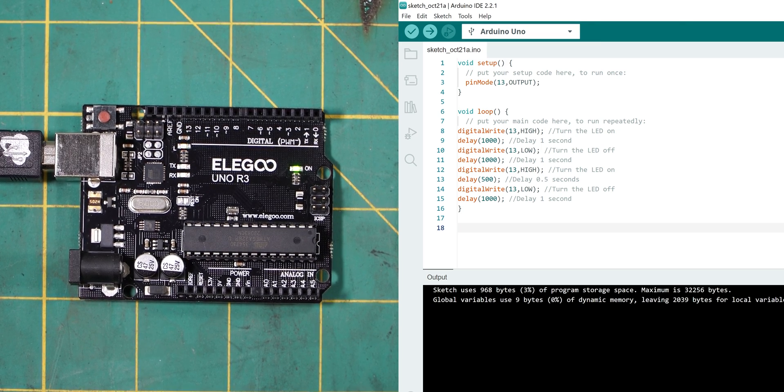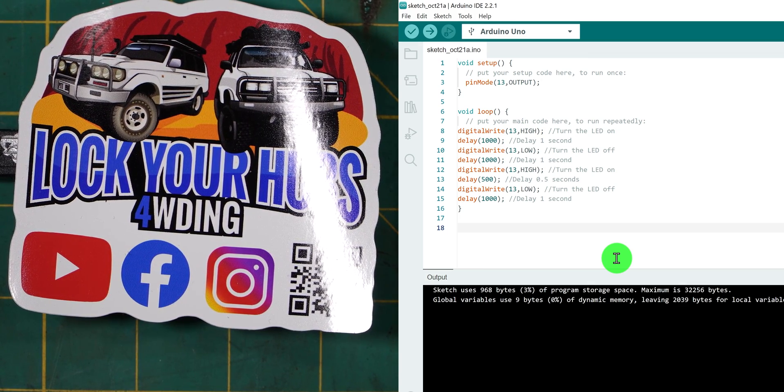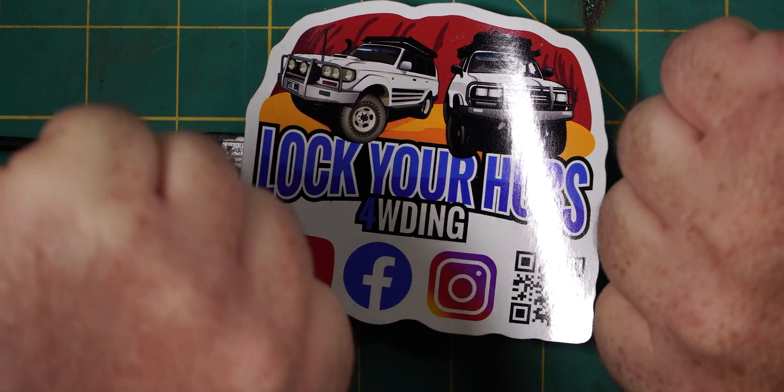Until the next episode is released, here's your task: get that light flashing SOS in Morse code. Morse code is sequences of dots and dashes — dots can be represented by the LED on for 300 milliseconds and dashes by the LED on for 1000 milliseconds. SOS is dot dot dot, dash dash dash, dot dot dot. The first to put the correct code in the comments section wins a sticker. Please don't cheat with ChatGPT, and experienced programmers, give the others a chance. If you liked this episode give it a thumbs up. Thanks guys, we'll see you in the next one.